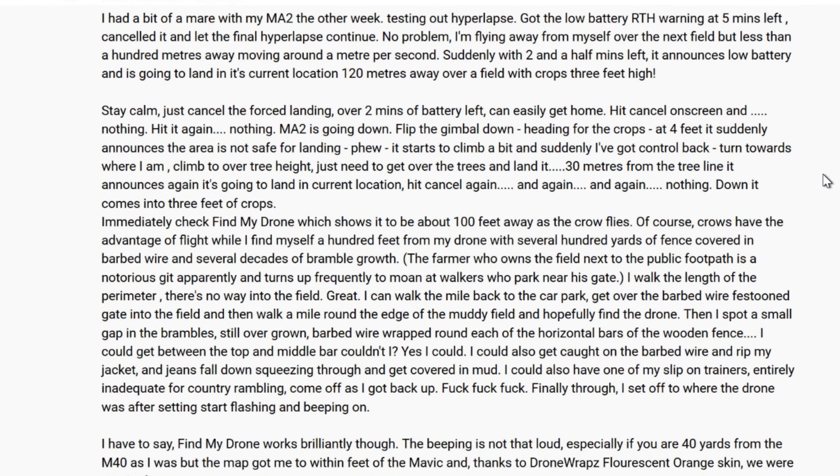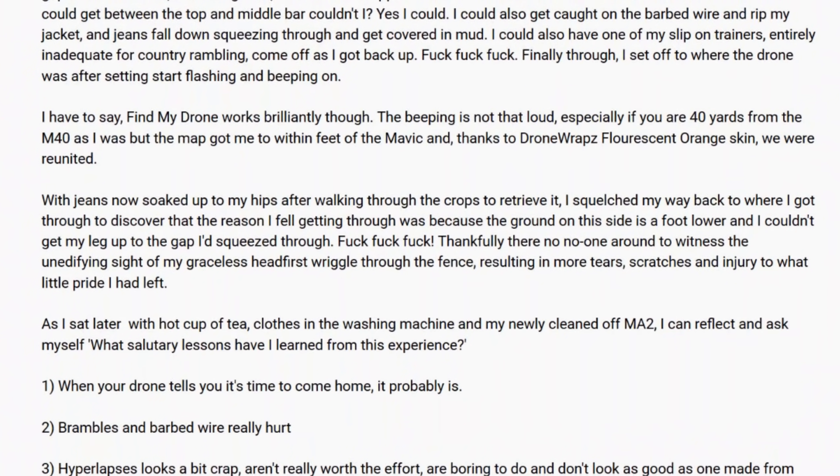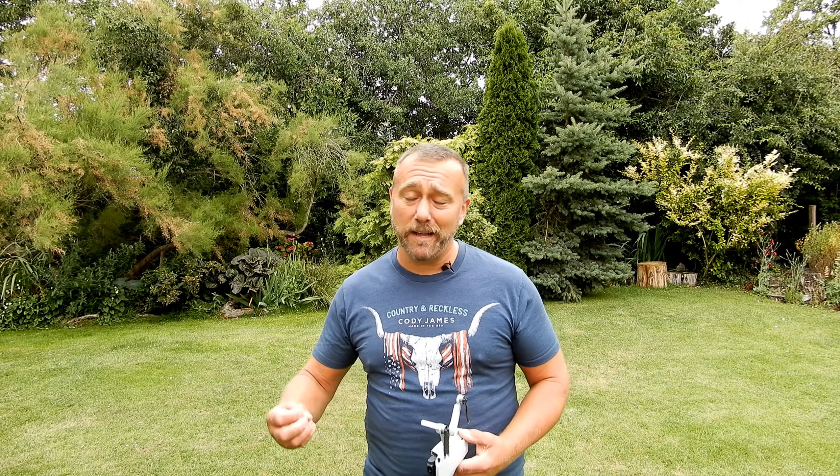The reason for today's video is it's been inspired by the tale of woe that one of my subscribers outlined on a pretty long message on one of my videos the other week, where he described cancelling the low battery return to home, but then got caught out by the critical battery auto land that he couldn't override. Despite the drone only being around 40 meters away from himself, it ended up landing in a place that he just could not retrieve it from — taking him about two or three hours to actually manage to get round and retrieve the drone. So I tried to explain that there are certain features you can't override, but there are certain inputs you can put onto the remote that will actually slow down what's happening. Either way, I thought it would probably be a good idea to go through exactly what happens as the battery is getting low, what functions are going to kick in, what you can cancel, what you can override, and what you can steer and slow down to try and stop something going wrong too fast.